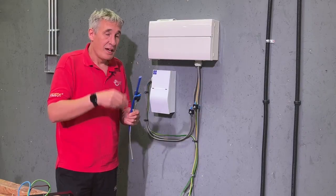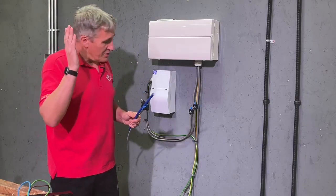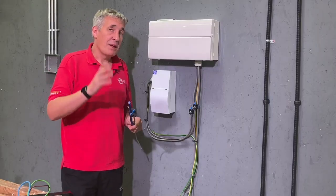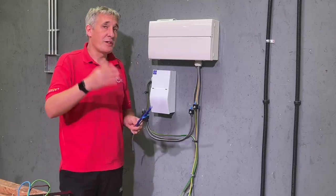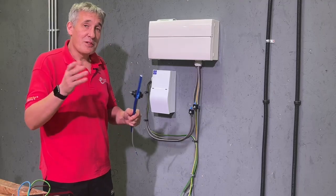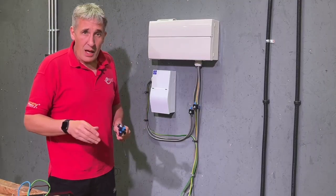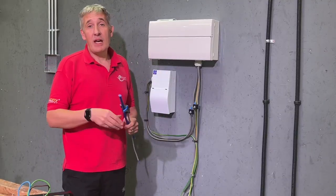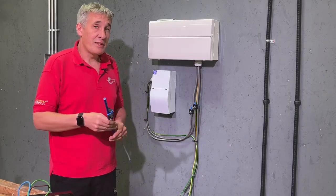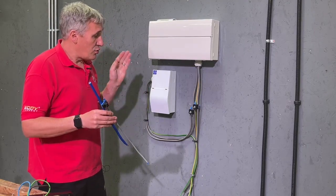A lot of the tests are done on those aerial bundle conductors, which often have XLPE insulation and a very thin outer protective sheath. So what difference does that make? You'll see in there those little connection areas are pretty pointy and quite small when you consider the size of cables we're using here. We're already seeing pictures of these installed on Instagram, and there's the myth and legend — people have seen manufacturer test data and somehow show that's acceptable. We've also heard that DNOs are refusing to connect installations where they see these, and a cursory discussion with NICEIC inspectors suggested they'd have to be put in an additional enclosure, which would echo what we said about that cable connection. Could this speed up EV charge point installation? This is an area crying out for innovation.